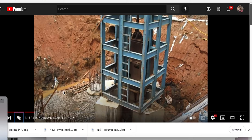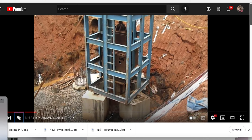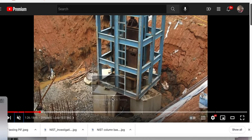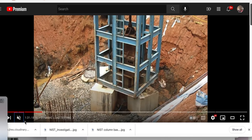So it would probably be a raft slab. I state that because no one would put these columns that close going all the way to the building. They put these concrete columns in there — actually just distribution blocks — to help lift this up, so they can distribute the load equally around the outside of here. They literally come in low down with the crane — they even had to shim this one — and they put it down, and then they can lift it up and drop the load on it.